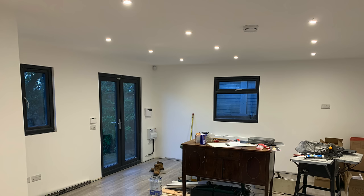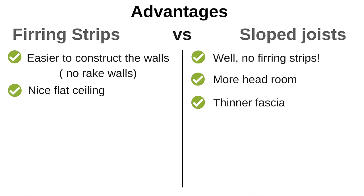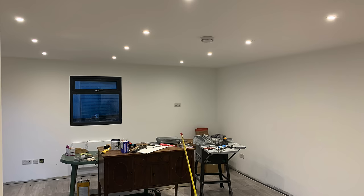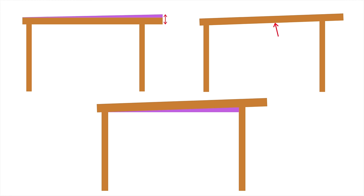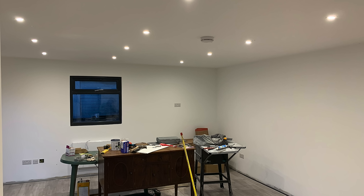Now that it's painted there's one other thing I want to point out. Back in part 9 we compared the pros and cons of sloped roof joists versus furring strips, and a potential drawback of the former is having a sloped ceiling. I don't notice it too often but it's quite nice seeing the structure of the building rather than just having a plain cuboid. Someone mentioned they didn't want the extra thickness of a fascia from furring strips nor a sloped ceiling, so I came up with attaching the furring strips under the joists — but I think it looks fine with the slope.